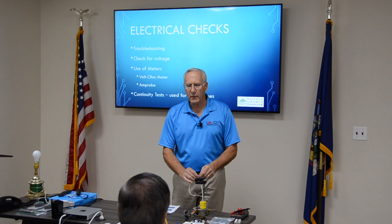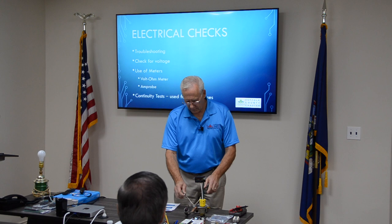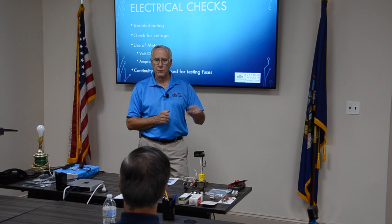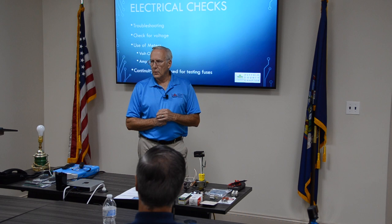Why do I say that? If you're going to humanly touch an electrical circuit, whether it be a wire, a clip, anything, you want to make sure that it's dead. You can't see electricity. You have to test it with a meter. You want to make sure that your reference point is always the earth. Why would you think I'd want the reference point to be earth? Because that's what you're standing on. You're standing on the earth.